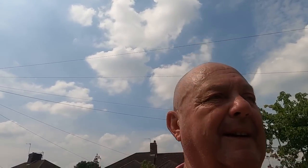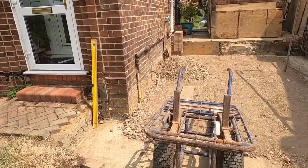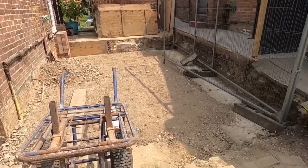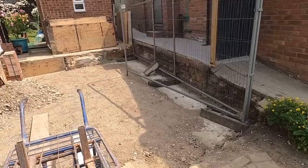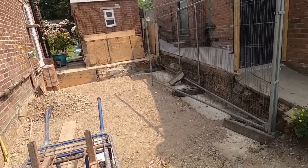Well, it's too hot now isn't it? I can't stand it. Right, I've come to this job today — I wasn't supposed to come until tomorrow because the bricks are only coming today. There's a little garage and I was hoping it was going to be straightforward, but there's nothing straightforward about it at all. It's under a slope, so it squints here, squints that end, and we ain't got any squints and we're not going to get any, so that's going to look lovely isn't it.